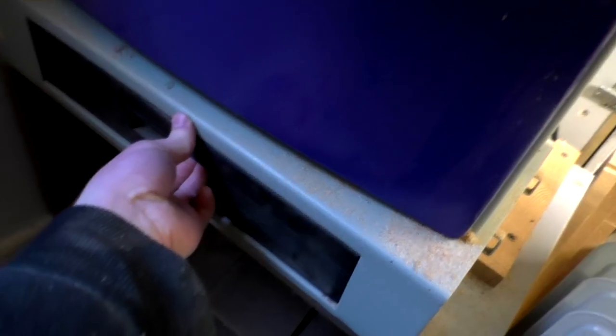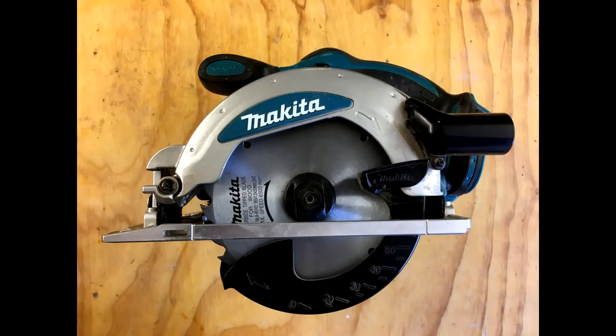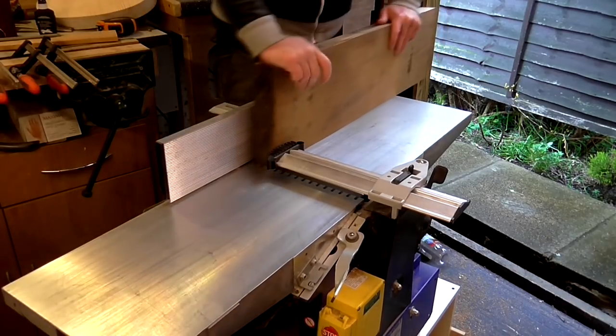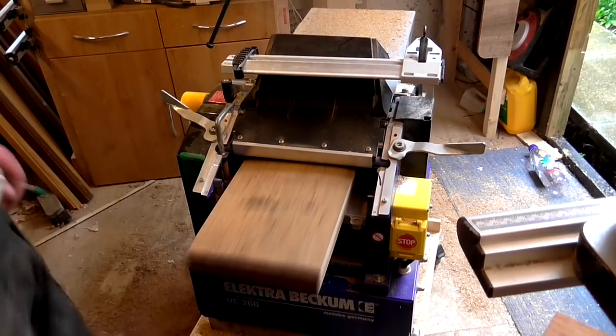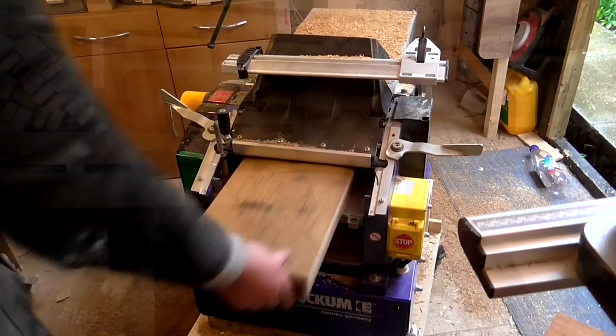Most of the time I'm just doing quick cuts, so usually I'll just rely on the passive dust collection, which is a dust collection drawer at the bottom of the band saw that collects most of the dust. I also use the second shop vac for powered hand tools such as my random orbit sander and my circular saw. There's one machine I don't have any dust collection for — my thickness planer and jointer — because it creates such a high volume of chips that it requires large 100mm diameter hoses, and the shop vacs would just be filling up too quickly. So when I use the thicknesser or jointer I basically just wear a respirator and sweep up afterwards.